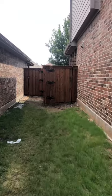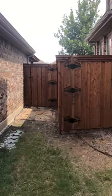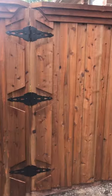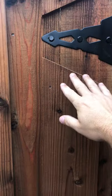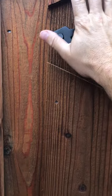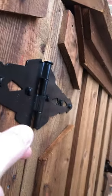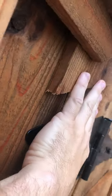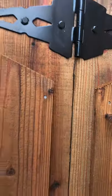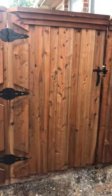As we walk up to these fences you can notice how all the black hardware looks completely finished out. The reason you can see it so well is because we don't cover the beautiful hardware that you buy or pay for. A lot of fencing companies will just cover this up, and that creates a little bit of an issue — you don't get that seal along here because there are a couple bolts in there, so you end up getting a gap or bowing behind it.